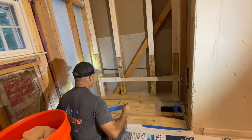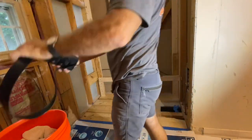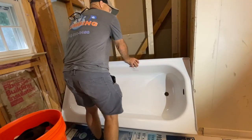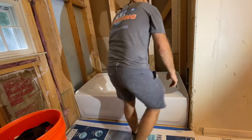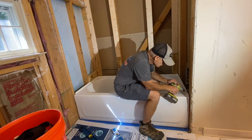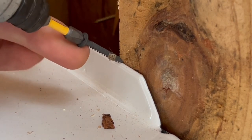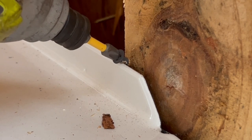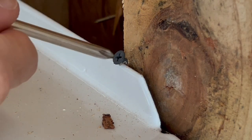I want you to notice how far I've got the sheetrock cut back to the left — you have to have the distance of 60 inches plus 30 inches deep so you have room to get that tub in front of the opening and then lay it down over in there. We talked about how important it was not to have this tub move, and a great tip is starting these screws at a little angle right there, applying just the right amount of torque so the head catches right on that lip — on as many studs as you can get a screw into.